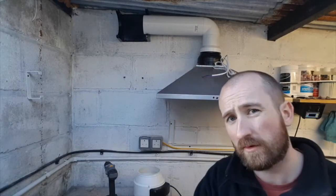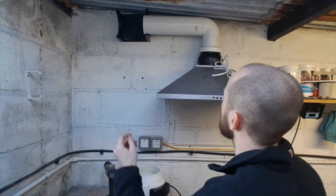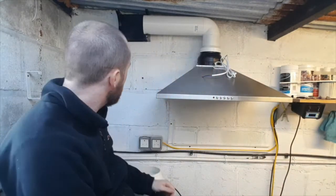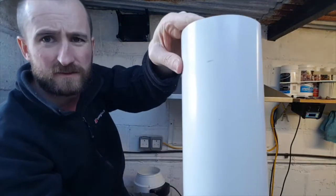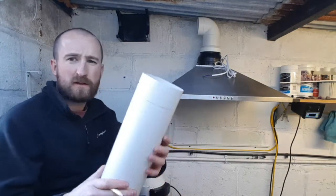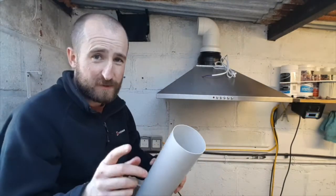Beautiful. If I take off 30mm, I should be pretty close then to where I need it. I'm taking off 30mm from the edge of the bracket that way. I could be a little bit more on the height. So 30mm from the edge of the bracket is there. Eyeball it, and there we are. Smack on.